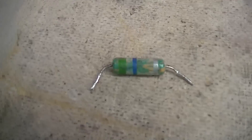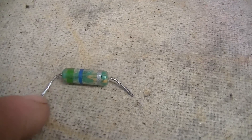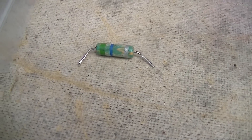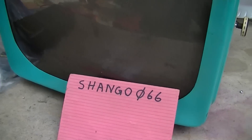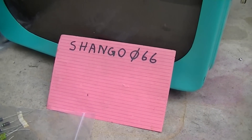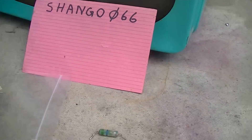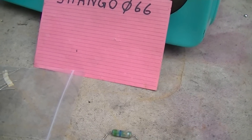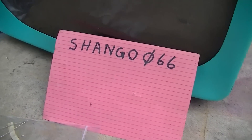The other thing I'm dealing with is this inductor. The schematic calls this a 5.6 microhenry, and it spells out 5.6 microhenry. I ordered some 5.6 microhenry coils. I verified the DC resistance, which really doesn't matter, because these things also have a current rating — you can have one with thicker wire that's the same inductance but the DC resistance would measure different. The approximate size of the ones I ordered was about the same.